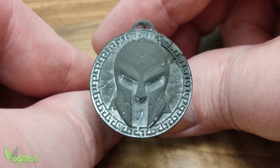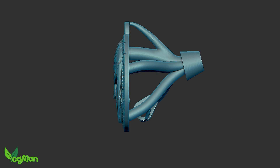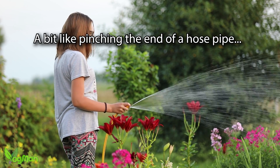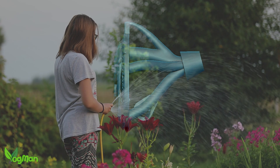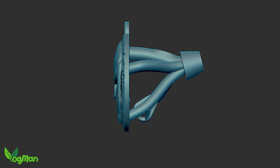If you look at the back, I designed this sprue poorly. It's never a good idea to go from thick to thin on a sprue, something I forgot about when I designed it. Some believe it can generate too much pressure during metal flow and cause the plaster to be damaged during the pour. In truth, I probably didn't need this sprue at all, but I could have also got away with a uniform thin sprue instead.